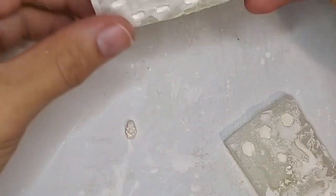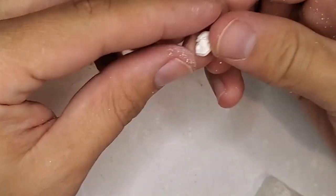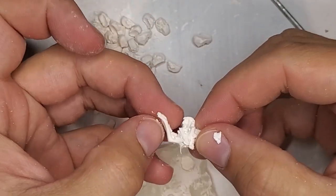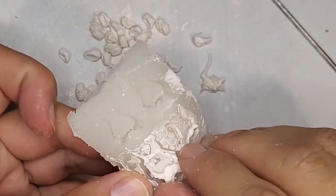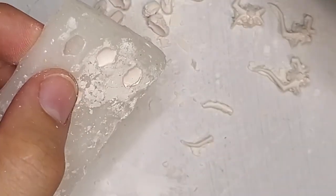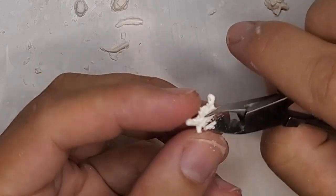I love just how easy it is to clean up the plaster — it is so soft and so brittle. Now, you might say that makes it a bad material, but it depends on what you're casting. When it's just going to be a pile of skulls in the corner, it's all good. The features that are simple in shape come out just fine, but those that have very outstretched details, like horns, are almost impossible to get out without snapping. But you can always try to get lucky. Because the plaster is porous, you can actually reinforce it after the fact by soaking it in very liquid glue — whether that's super glue or wood glue is up to you. Also be aware that it requires some kind of sealer like Mod Podge just to seal it in; otherwise it's going to absorb a lot of the paint you try to put on it.